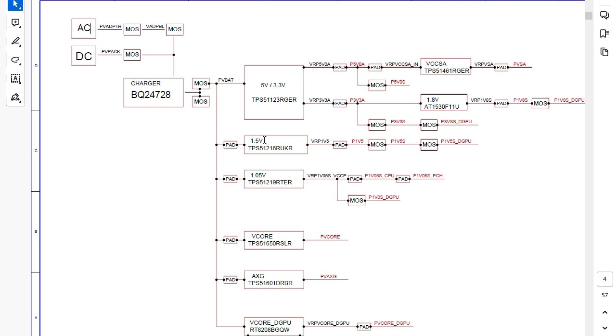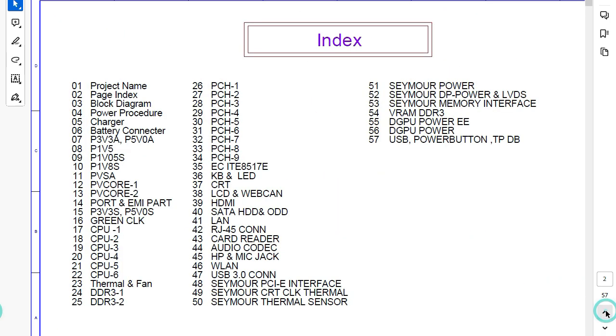For DDR2, the working voltage is 1.8V; for DDR1 it is 2.5V; for DDR4 it is 1.2V; and for DDR5, the working voltage is 1.1V with a VTT of 0.55V. Here we also have 1.5V to feed the chipsets — this is the VCCP voltage, and you can find 1.05V or 1.5V for it, exactly as shown here with the label 'one V5,' meaning VCCP.